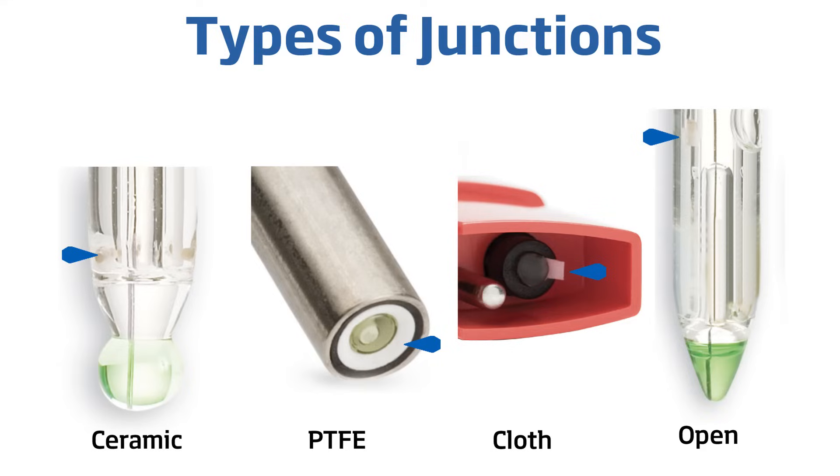Polytetrafluoroethylene contains hydrophobic properties, providing one of the most chemically resistant junctions available. It is commonly used in pH sensors for industrial applications because of its chemical advantages and durability. A fiber wick junction, also known as a cloth junction, allows for a quick refresh when readings are erratic or unstable. An open junction does not have a frit — the electrode uses an exposed hard gel as a junction. This layer is silver-free and has a high flow rate, making it ideal for samples that would clog the junction of standard pH electrodes.